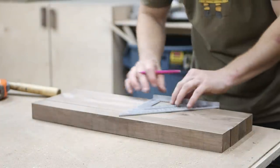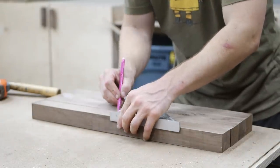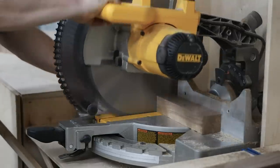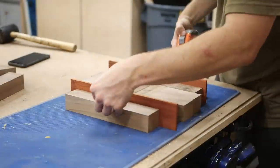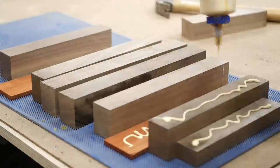I had the idea to do a thicker walnut seat with a little bit of Padauk accent in it. Now I didn't have much walnut left, so I was pretty careful about my cuts and measurements for this. I also planned to make this seat circular, about 12 inches in diameter, so I marked and measured things out so that I could make a seat that was in the rough shape of a circle and preserve material in the process during the glue-up.